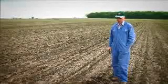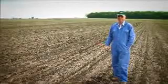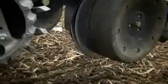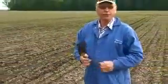Central fill — my wife was tired of filling the boxes individually, so I was forced to get a central fill in one respect. With the Great Plains planter you have a leading blade and a lagging blade which makes a narrower, cleaner trench. If the blades are opposing each other nose to nose it wants to bulldoze, but the way the Great Plains lags it tends to cut a trench — a huge advantage. There are another manufacturer or two doing that, but the majors aren't.